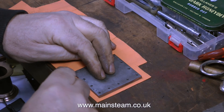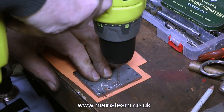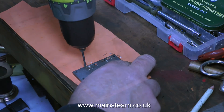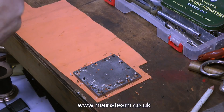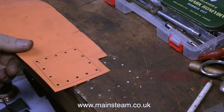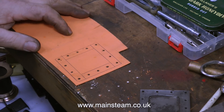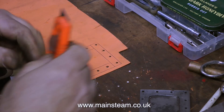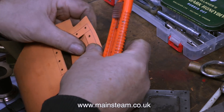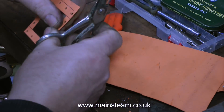I have to make a gasket now. I've cleaned up the steam chest cover first in the bead blasting machine then finished it off by hand with some emery cloth. I didn't use the ink pad method because that's at home in my workshop. I simply drew around the steam chest cover on a piece of gasket material and then drilled down through the holes to make corresponding holes in the gasket material. What I need to do is cut out the centre of the gasket material, so I drew some pencil lines on it. I found a knife which was very blunt but it's one of those where you break off the blade and start with a clean bit — and I'm forced to admit it is much better than the scalpel I use in my workshop.